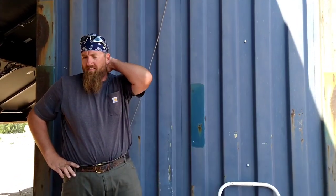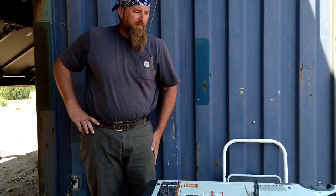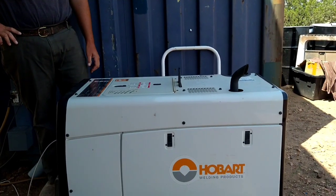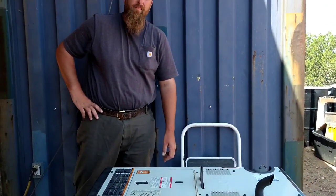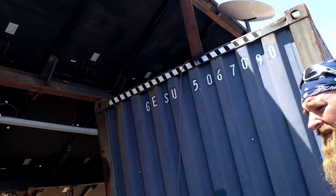We're currently using approximately 23 kilowatts a day — that was the last number the battery management system put out, and that was before we started running the air conditioners. The generator is underpowered for the system. The system can take an input of about 320 amps, so 30,000 watts incoming. Right now we have almost 20,000 watts when the sun is at its highest point. This panel system will charge double the amount of batteries we currently have.